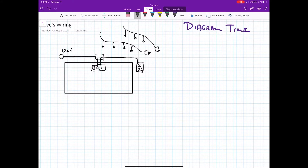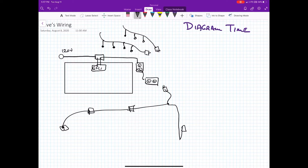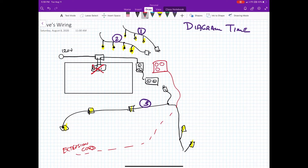There are two string light circuits going into those two receptacles, plus a power strip with a couple more plugs. Then there's a third circuit going out to some overhead lights, and some post candlestick lights. So there are more or less three circuits. Since the GFCI doesn't work, an extension cord has to be run out — which is pretty gimmicky and lame.